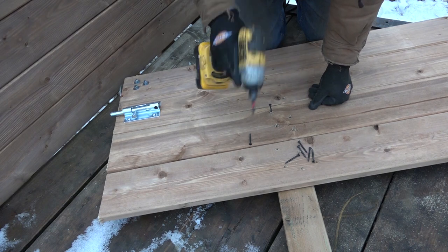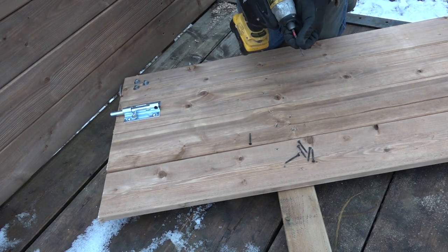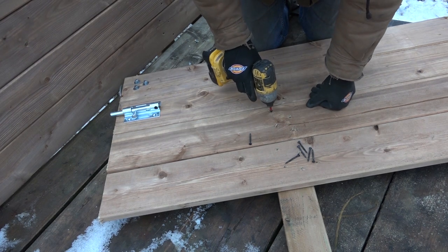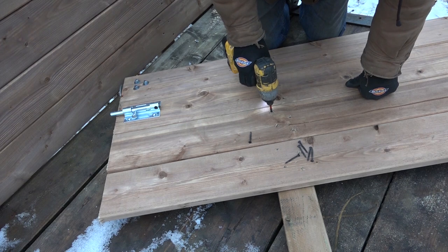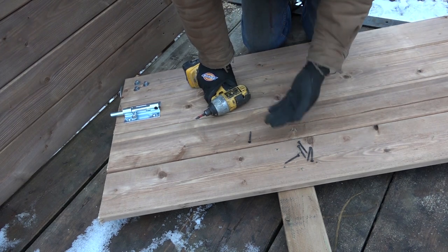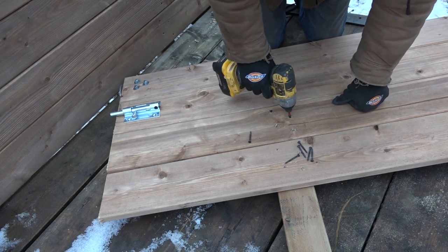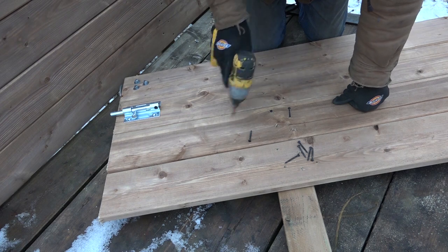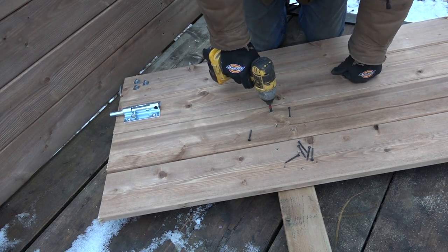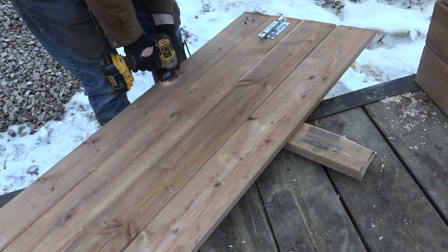If that's the case, when you take that last screw out and the whole board comes out, it's because the head is behind the wood, and it pushes it up. What you do is, you take the second last screw out halfway. That way, that screw's still holding the board in. The board can't come out. Take the second last one out halfway, then move to the last one, take it all the way out. It will come out because that one's still holding it. And since this head is above the wood, it all comes out nice and easy.